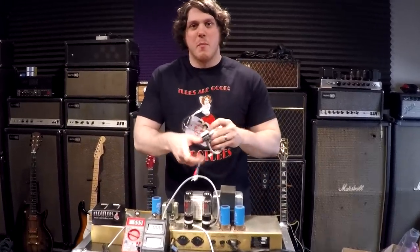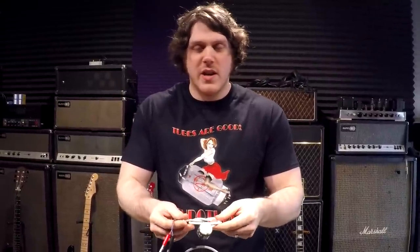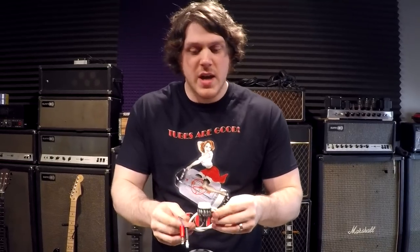Let's start off with our basic bias probe head. These guys are about 25 bucks right now, but they're a really high-quality unit — really nice ceramic socket, really industrial style banana plugs. They're going to last a long time. They work great. One thing that is true with all of our bias probes is they measure actual DC plate current. We don't use a cathode reference, so there's no screen error and no sense resistor to drift over time. They're just very accurate and very reliable.